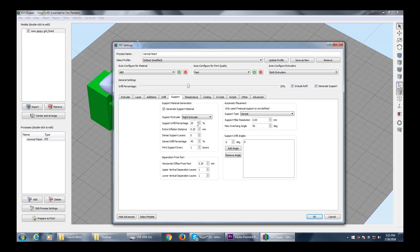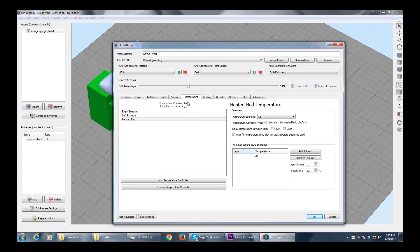The minimum I always put to zero. Now we go to the supports — it's pretty open, so we'll push the support percentage up to 30. Now we're going to add a dense support layer — this means exactly what it says: it'll be denser, and in this part you can make the percentage higher. So it was 30, now it's 45 — we'll take that up to 50 because it's quite a detailed model. Horizontal I think at 40, because I'm using ABS as my support material and I want good distance, so we'll put that to 42.